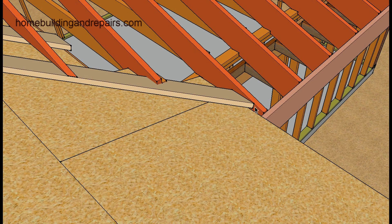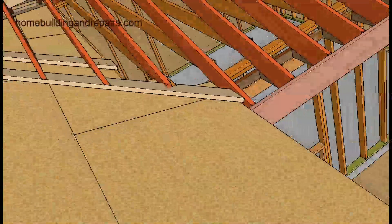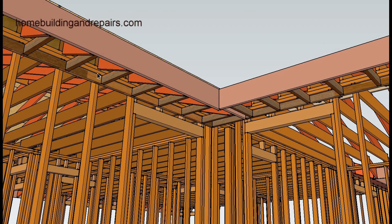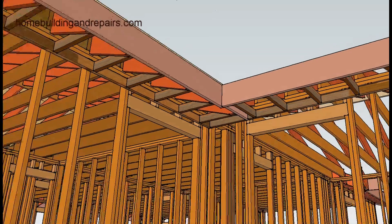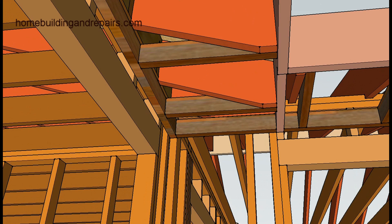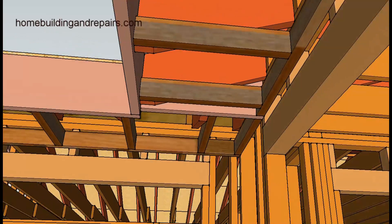Another view. You can see the fill dying right into the roof rafter there. Take a look at the soffit to give you a better idea. This would be a soffit that probably would have plywood, some type of siding, or even stucco going underneath it. This would be covering the area underneath so you wouldn't need to put a hip in here — it keeps things nice and neat. You can do something like this and it would work.